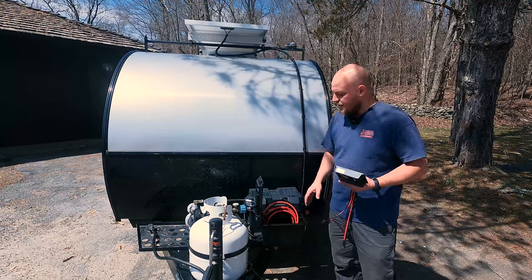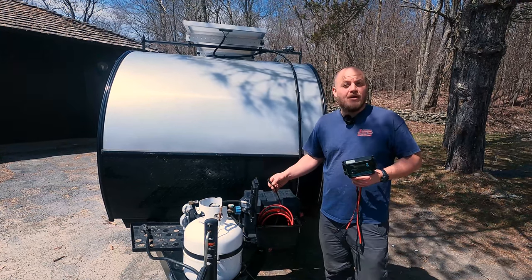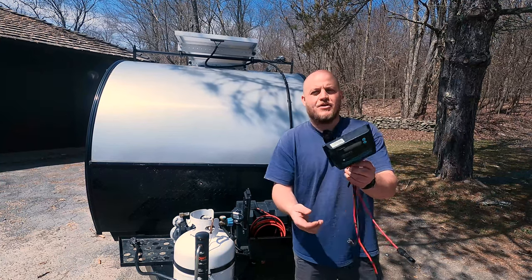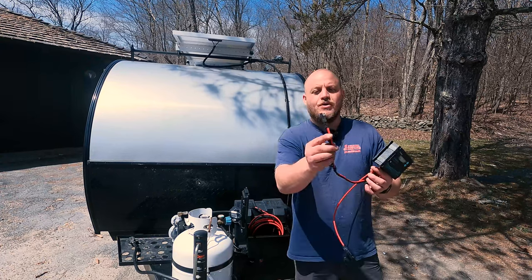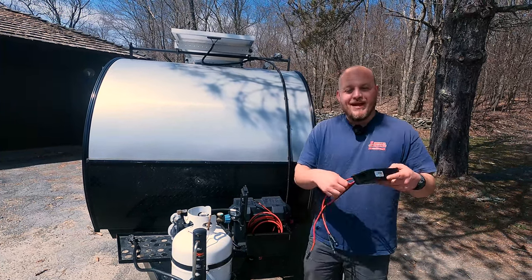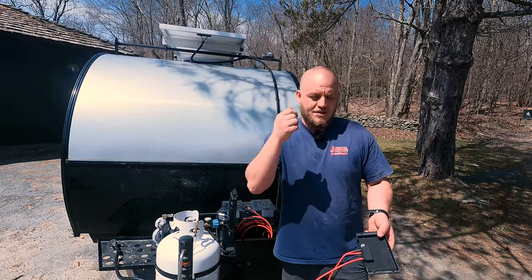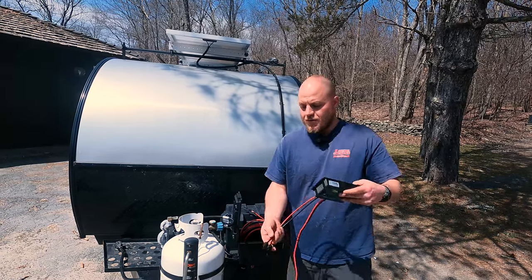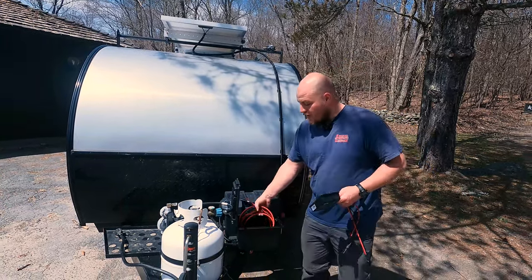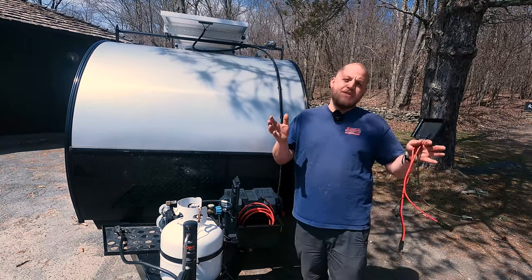Okay, we have everything dressed up and looking good. We can now wire our charge controller and get ready to install it in the box. In the box I have an SAE plug from the extension plug from the battery, so I'm going to install a corresponding SAE plug on the battery section of my charge controller. I use little fork connectors to go into the charge controller and line up the SAE so the polarity — red and black — lines up with the feed from the battery. On the panel side I attached two MC4 connectors. If you don't want to make these yourself you can buy a short cable and cut it in half. This gives us a charge controller that can fully unplug — plug and play — which gives us a lot more capability.